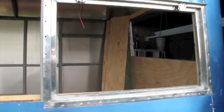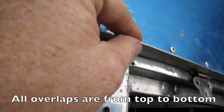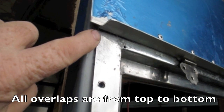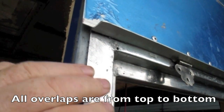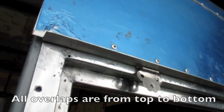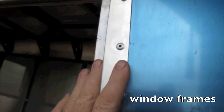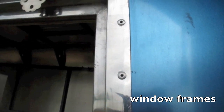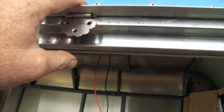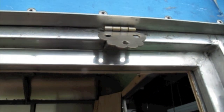As part of the cladding process we install the window frames. It's important to do this because the cladding goes over the top — the cladding comes down to the sill and the sill is over the top of the frame, which sheds water so it runs out. Every layer in here has been Sikaflexed in: under the frame, between the frame and the sill, and between the sill and the top cladding, so water can't ingress back into the frame. We clean these frames up before putting them in because they're quite hard to polish in situ — the frame has been paint-stripped and polished up fairly well beforehand. Same goes for the butterfly hinges; you want it all waterproof, so do those before. We've got a separate video on how to clean up the windows and hinges.